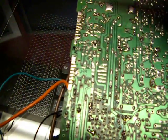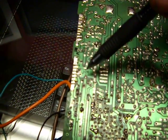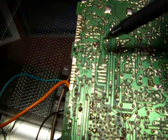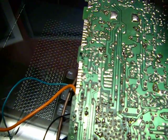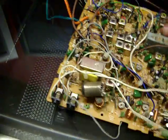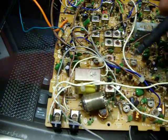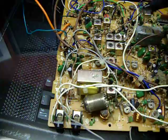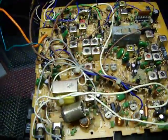Once you get that done, the radio will perform the way Uniden originally designed it to perform back in the late 70s, so that all the power to the radio itself comes through the back of the radio, whereas the power going through the audio chip is filtered through that choke — which is the design. This modification allows you to run more power; if you want to run an NPC mod or something to the radio, it will remain stable on sideband.